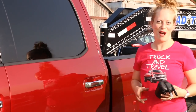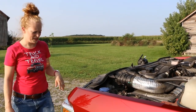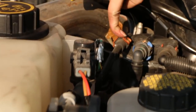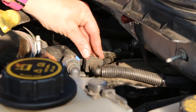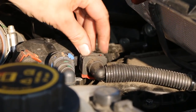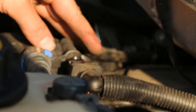Now it's time to go ahead and pop the hood. There are three lines that we have to disconnect — this is the second fuel filter. There's one, two, three, and they all disconnect differently. For this first one, you're going to squeeze both of these and push down, and you can see the red goes down. After you do that, you're going to pull it. There's one.